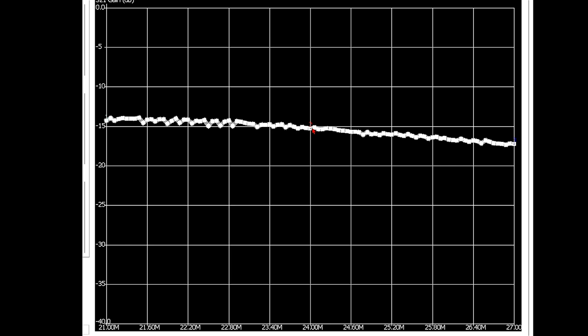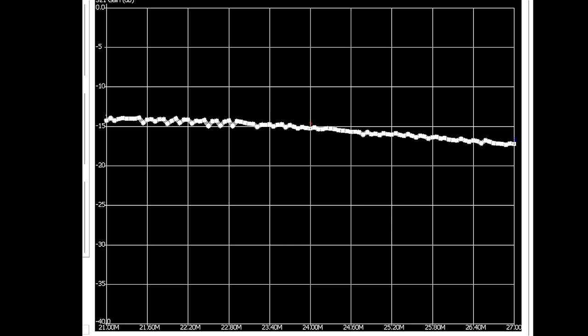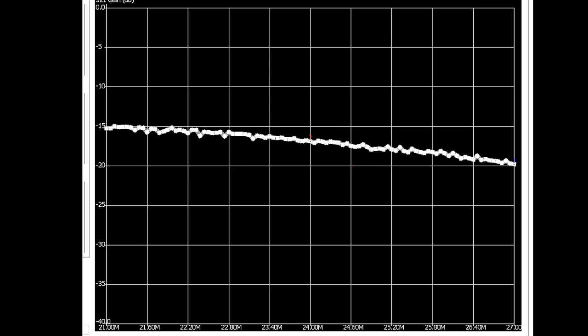That's a pretty small change. We're at about 16, 17 — let's say 17 dB. Try one more. I'd like to get to 20. Pretty small change, 17, 18 dB — maybe we picked up another dB. Here's one more — that's 12 beads. Sweep again — again, a fairly small change, maybe 18 dB. It's 20 dB up at this frequency.